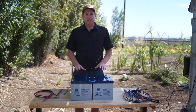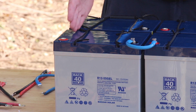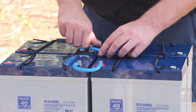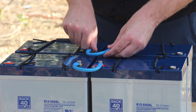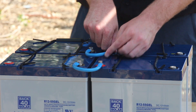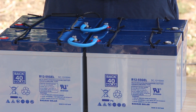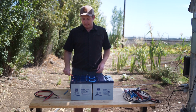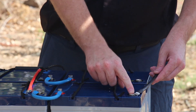We've added two more batteries. When laying out batteries, I always like to put them in the same orientation — positives on the right side, negatives on the left — so when wiring up we can go right across the battery terminals. We'll do our series connection on the new pair. Now we have two sets of batteries in series. To stay at 24 volts we can't do any more series connections. Now using a red jumper we jump the two positive terminals together, and a black jumper to jump the two negative terminals together.